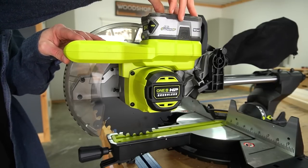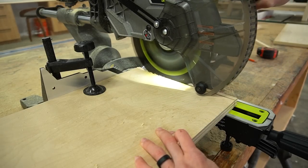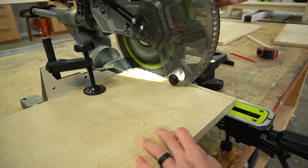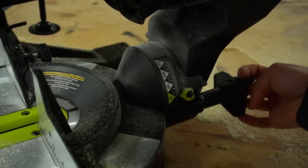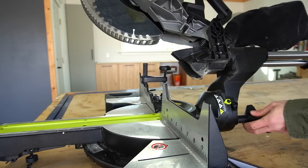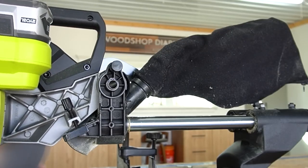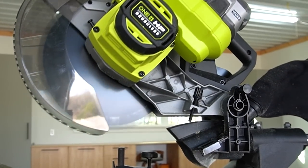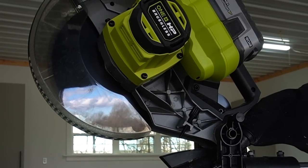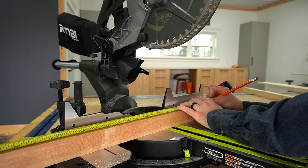That's why having a cordless option is really great, especially if you ever work outside the shop like I do. It runs on the same Ryobi 1+ 18-volt batteries that my other Ryobi tools use, and one high-performance battery can last up to 550 cuts. This saw has a miter range of up to 47 degrees both left and right, a bevel range of up to 45 degrees, and a cross-cut capacity of 12 inches. It's part of the HP lineup — high performance tools with brushless motors for longer tool and battery life. It's available exclusively at The Home Depot; check the link in the description below.